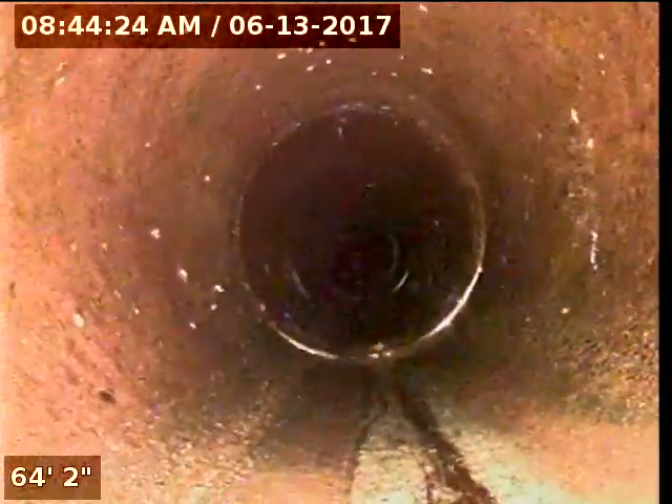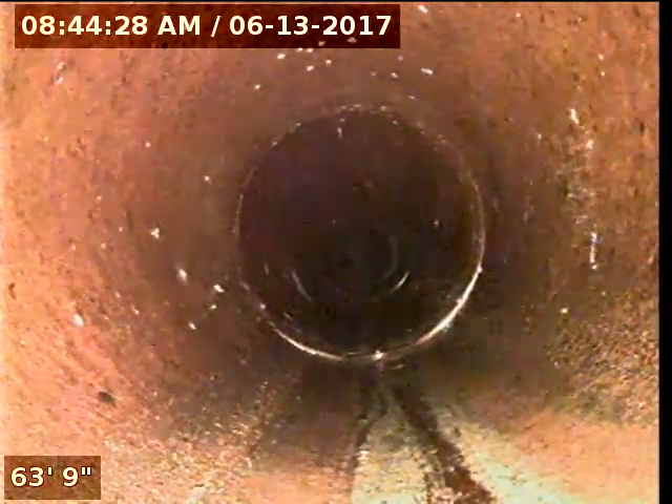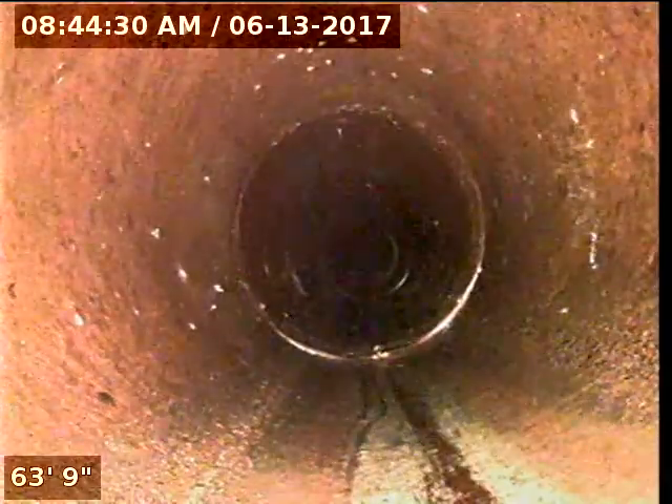So here's the city — 72 feet. The joints down here, past about 60 feet, were pretty clean, looked really good. That's further out by the street. Your sewer is actually doing something kind of weird where it goes straight out, then takes like a 45 this way and then a 90 that way. Let's see that as we come back to it.